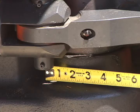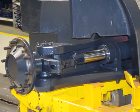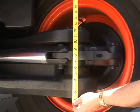These types of bearings offer maximum surface contact area, helping them to more completely absorb and effectively dissipate impact forces traveling up from the steering tires and wheels, then through the steering axle. Finally, make sure that your steering axle incorporates lots of grease zerks, and take the time to inspect and measure the size of all steering axle components before you sign on the dotted line. This could help you avoid a lot of aggravation and save you a lot of money down the road.